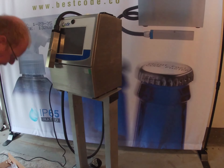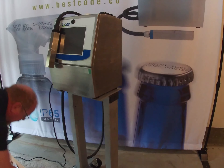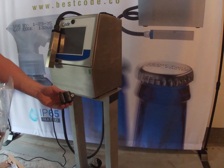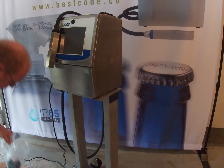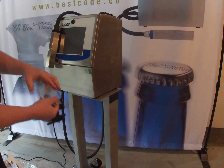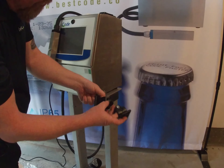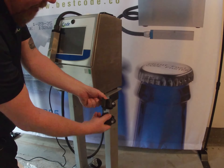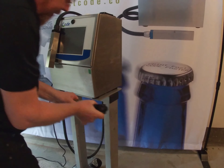We have here the side conveyor mounting bracket. It consists of a long post, a short post, and a bag full of different brackets, along with the bag of nuts and bolts that secure these to the side. When mounting these, you have the Allen wrench on one side and the nut on the other — it's always a good thing to have both Allen wrenches on the same side. I'm going to use these screws now to fix them onto the side of the floor stand.